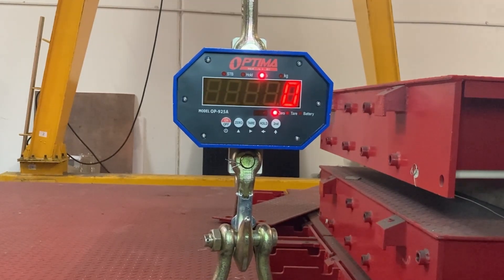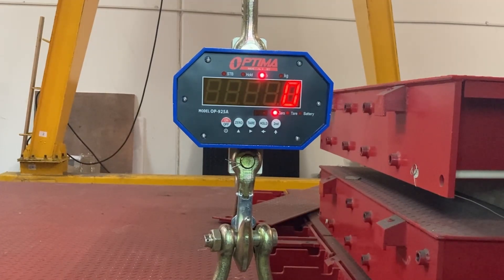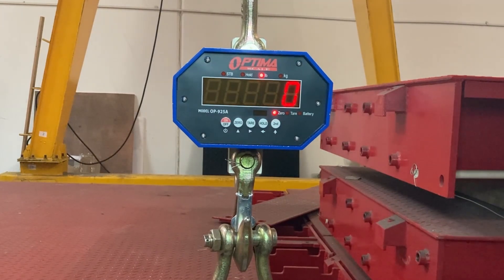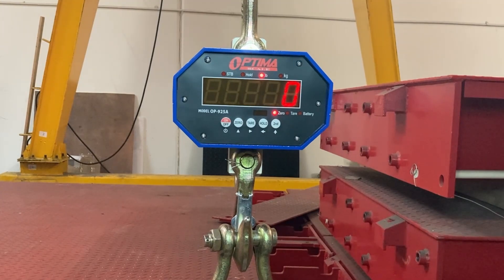This is how we set this crane scale specifically for 40,000 pounds by 10-pound accuracy. And if you hit the max capacity, it's fine to try it again with a higher FS value. If you have any problems — I know on the chart it might say a recommended minimum weight, but you could always use less. For example, this recommended me 6,000 pounds but I used 1,000 pounds and it calibrated fine. So it's up to you and your application, but this should be fine.